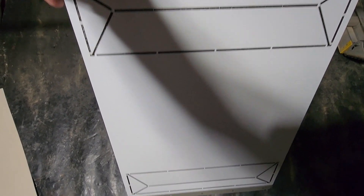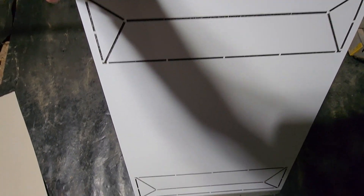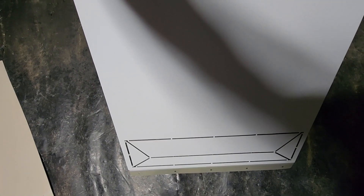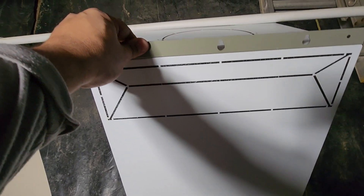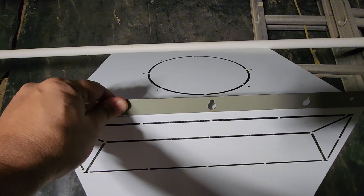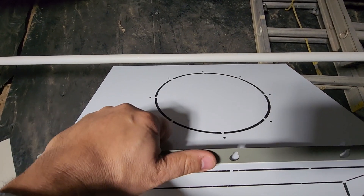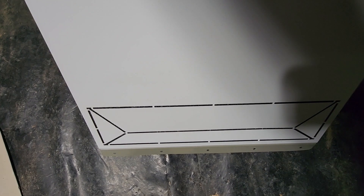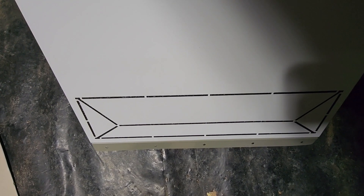This would be really good for a vertical duct drop, like you see in a lot of basement installations — the air comes in through the top and leaves through the bottom. Now my parents' installation is a horizontal furnace, so I'm going to have to actually do a little bit of a hybrid of the two. I'm going to be pulling my air through this eight inch circular hole, and I'm going to be delivering it back into the return plenum via the back discharge opening here.